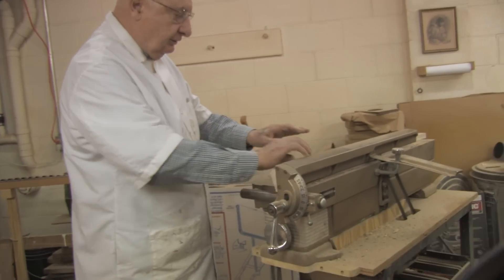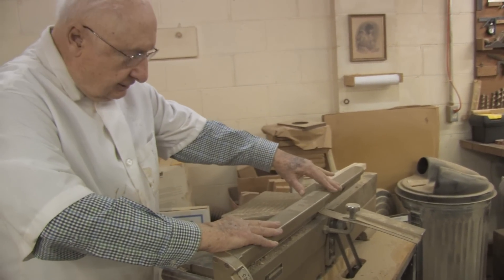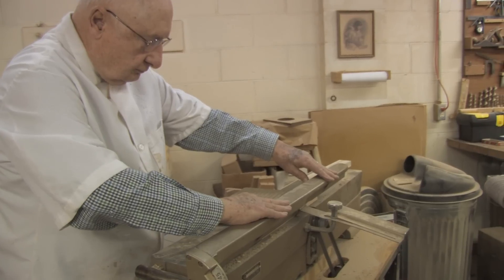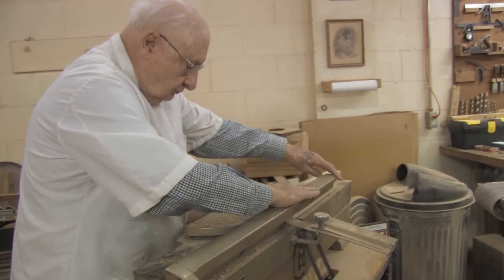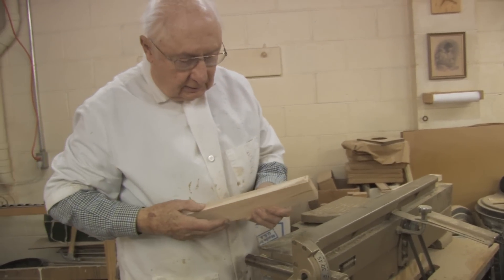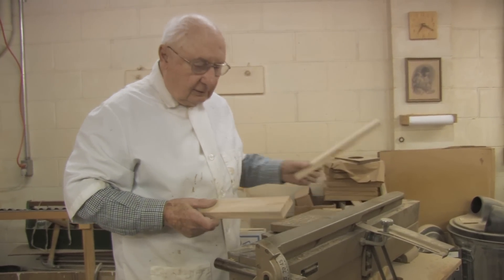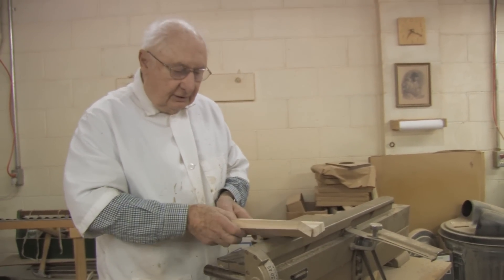You use it like this. Notice that I have to keep my fingers held in this upper position, guiding along the top layer. That will produce a finished cut which is perpendicular to the faces, and will allow you to join the two pieces together like this — they will be flat and they will match.